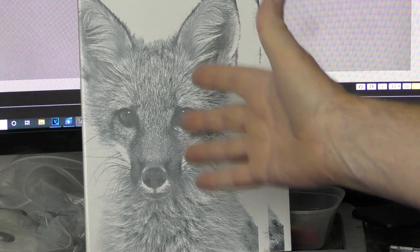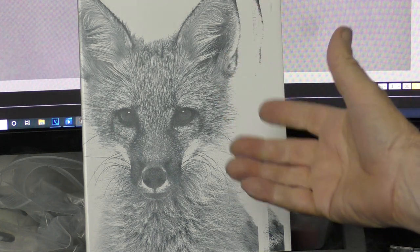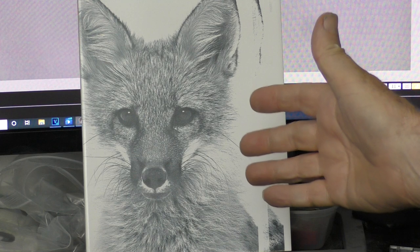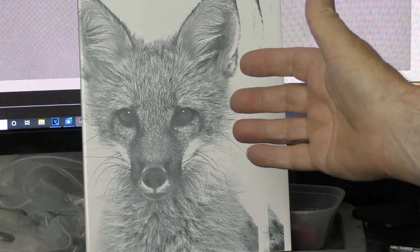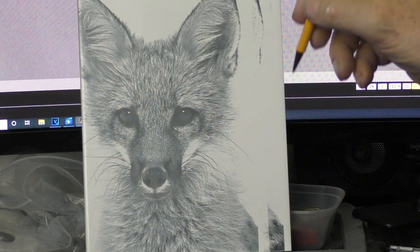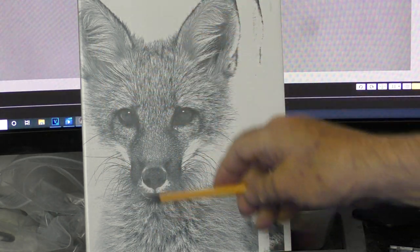Let's zoom in and look at a single pixel at 400x magnification to see what's happened to the glass, the tile surface, and the titanium dioxide. Lowering the microscope table takes the background out of focus. Raising it: high spots on the edge of the glaze melt come into focus, then the titanium dioxide comes into focus - roughly on the same plane. The melt has raised by roughly two or three microns above the surface of the tile. The black blob has sunk into the molten glaze and sits virtually level with the tile surface. Right around the outside of these dots there's a little encrustation of white titanium dioxide - it could be in a transition phase, starting to clump but not yet reaching the temperature to turn black.